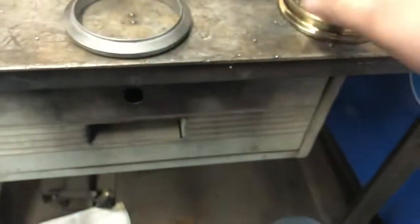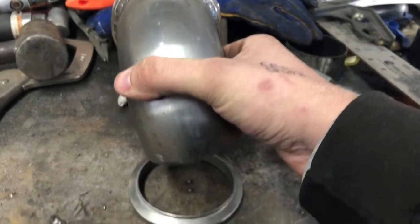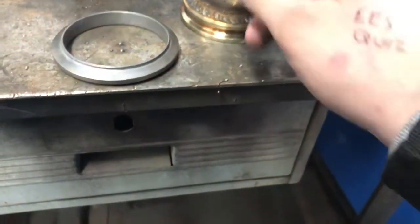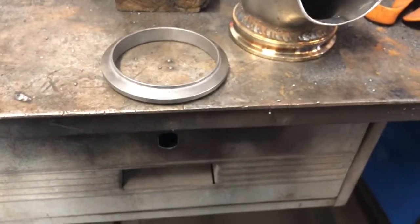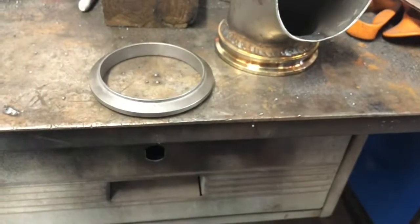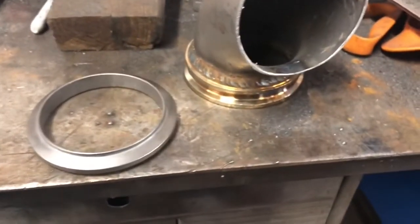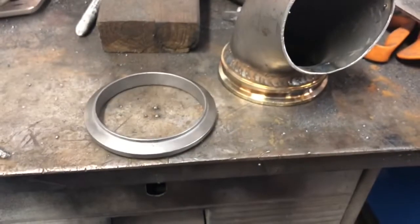You can picture this — the turbo sits about there, and now we're going to need this intermediate piece that connects the two. I'm not going to tell you exactly how to do this because it varies from one turbo to another. The whole reason I have to build this new one for myself is because that part is different from one application to the next. Otherwise I would have just made an exact copy, but because the housing on that other turbo application is different, it required changing that intermediate piece.